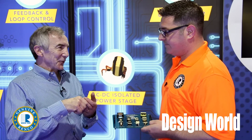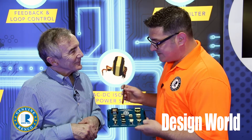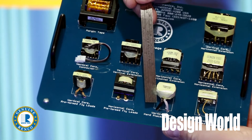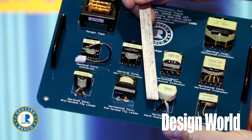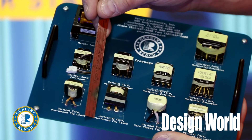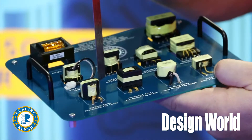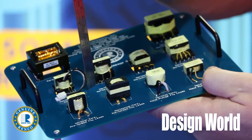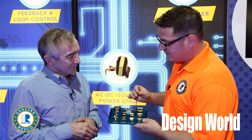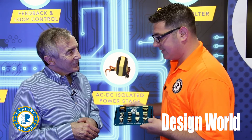Sounds like there are several options. Can you summarize them for us? Basically what it boils down to is: we have hand-placed fly leads; we have pre-formed fly leads where we pre-form them at the factory so they just insert right into the board at the contract manufacturer or OEM; we have vertical extended creepage where the bobbins grow longer; we have fly leads with little connectors; we have horizontal creepage where it grows left to right; and finally, the margin wound transformer.